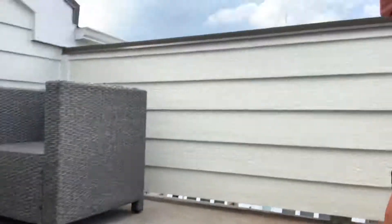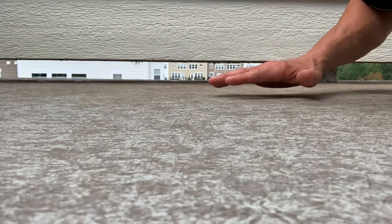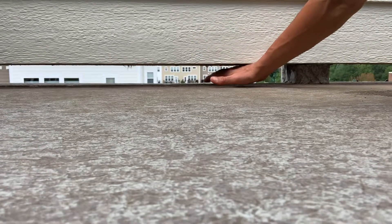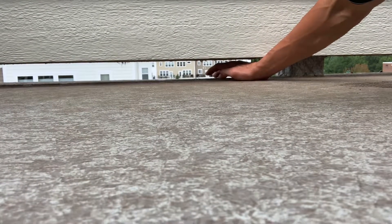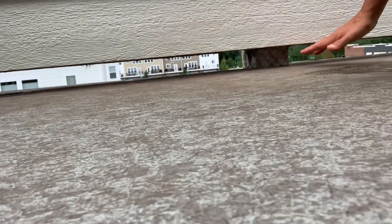You may get some pooling water here. This water runs off into a gutter — there's a gutter on the other side of this knee wall. In order to install the gutter apron, we have some flashing and some metal underneath, so again we have another high ridge where water can sit in this area.